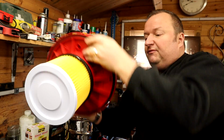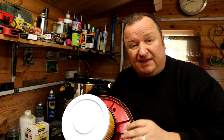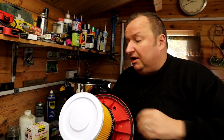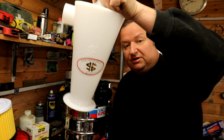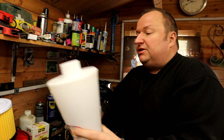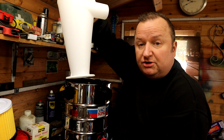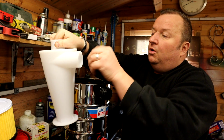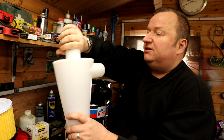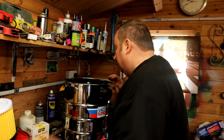Now as I say, with the original way of doing it, the filter, the membrane, gets blocked up in no time with all the dust. So including this cyclone device fitted onto a container, the dust actually comes into here, spins round and round and round, and literally just drops into a container, which we're going to bolt on in a minute, and the normal air just gets extracted away back to your vacuum cleaner without any of the nasty stuff in it.